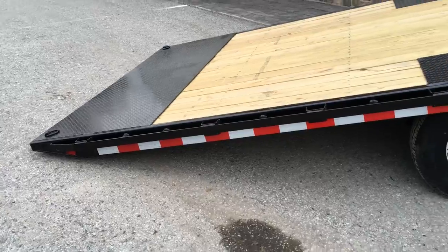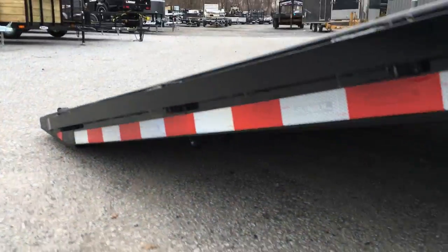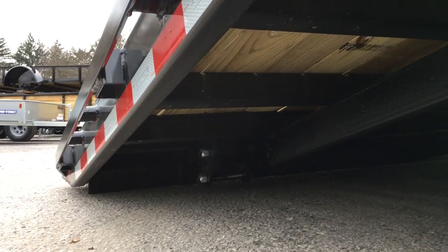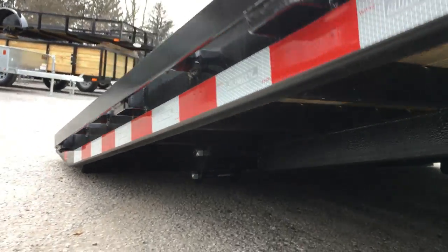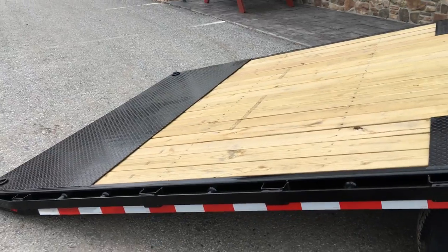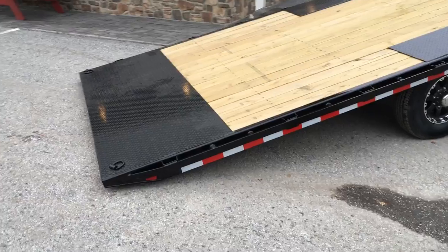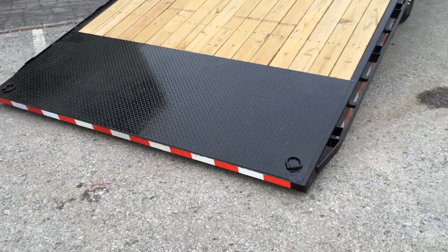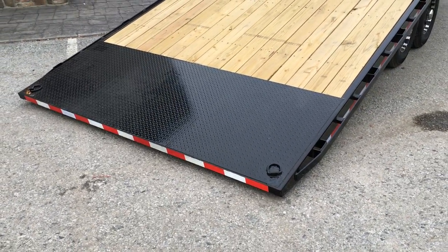One big difference I found on ShoreTrak — and this might sound like a silly item — is how the rear light bar mounts. The way ShoreTrak mounts their light bar gives structure all the way back into the tail. I've seen some that literally take a torch and cut holes in channel cross members at the back, losing a lot of structure. We like how they mount their light bar much better — it's a better engineered design with a pretty low profile approach angle back there.